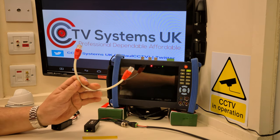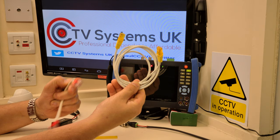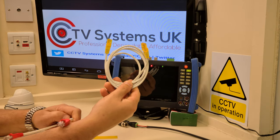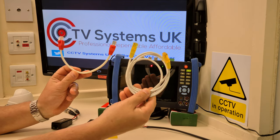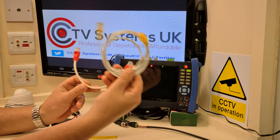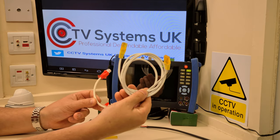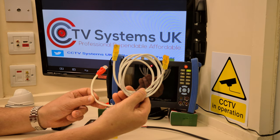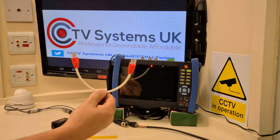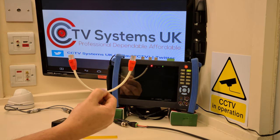Very quickly — don't use one of these. That's the sort of cable you get with Sky Television, your router, or BT. That is a normal CCA cable — it is not copper. Both CCA and full copper are Cat5, but don't use these little patch cables. Because they're aluminium, they do not have the bandwidth to cope with video pictures — certainly not HD pictures from CCTV cameras. Full copper cable will be rated at a full 350 megahertz, which is a nice wide bandwidth.